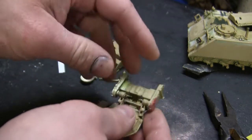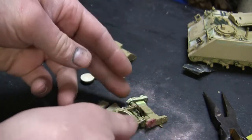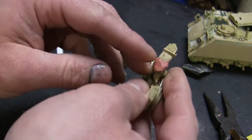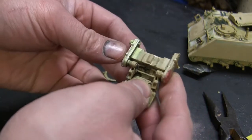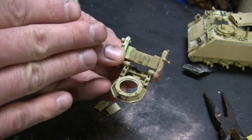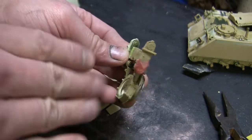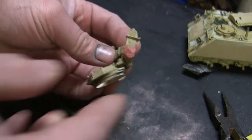Namely, when you hit it with a heat gun, not only does it become soft, but it starts crinkling and really deforming on you. I was able to straighten the piece out, and as you can see, it looks pretty good now, but sadly the detailing here had some severe deformities because of the procedure. Again, I'm just mentioning this because it's something that I don't want to see other people do, so if you are running into this, don't use the heat gun unless it's an extremely last resort. Fortunately, it's not terminal, because I am going to polish it up.